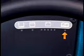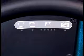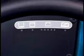If the fault indicator on the far right of the indicator panel comes on, there is a fault detected with either the propelling motor, vacuum fan motor, or brush motors. If this light comes on, refer to the table in the manual to determine the cause for the fault or failure and the suggested remedy.